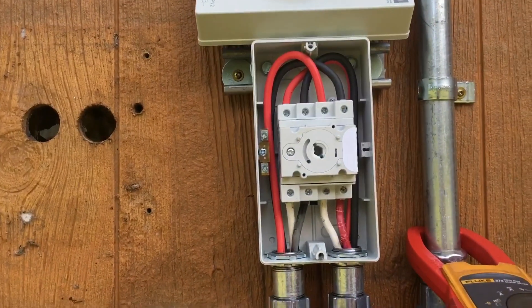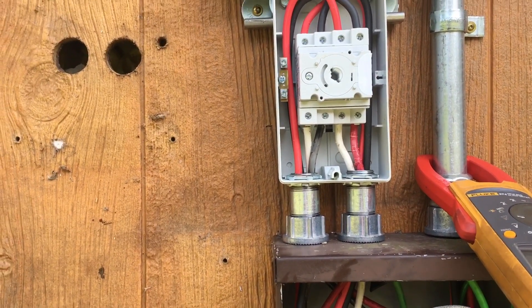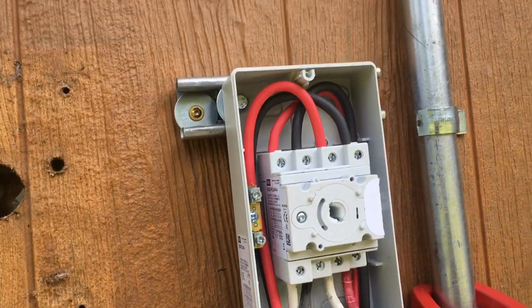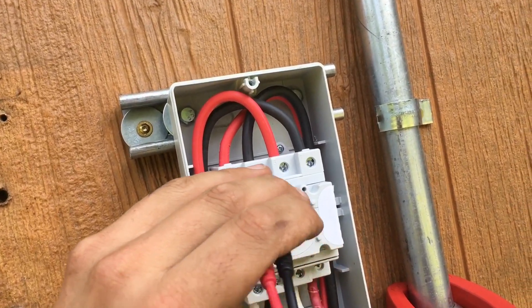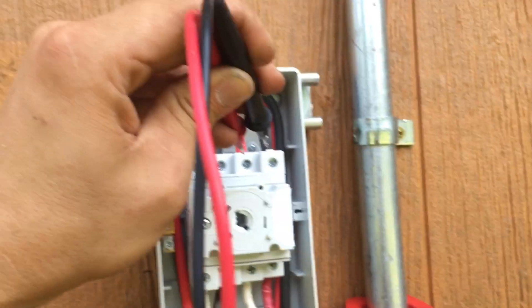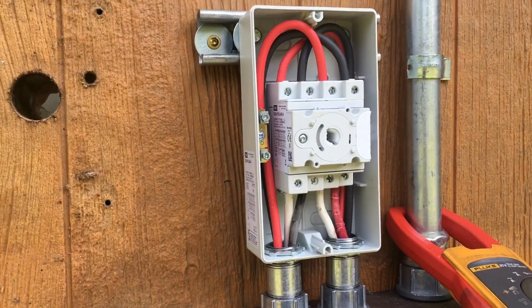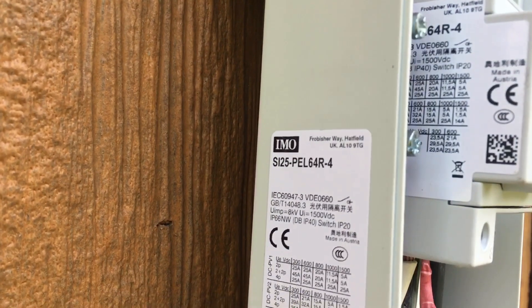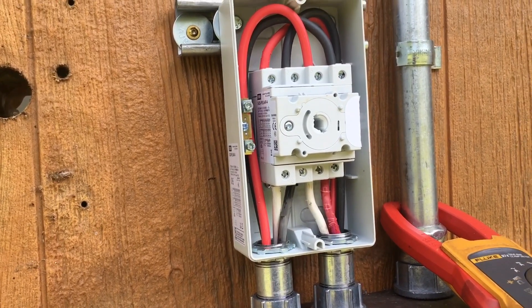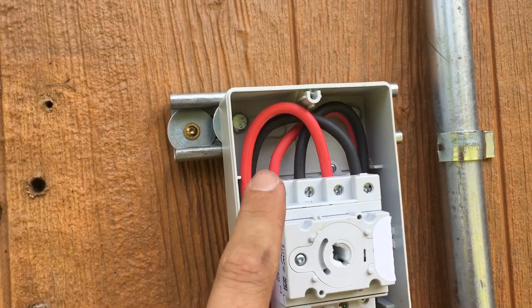A lot of you ask me about these IMOs. The body of the switch itself is a little bit flimsy, so I always like to mount it on a piece of strut — really get it solidly attached. Standing on some pretty solid nipples, but the switch itself is pretty bulletproof. There is 270 volts on the string of seven, and 315.8 volts on the string of eight. It's kind of hard to wire one of these four-pole IMOs — this is the 25-amp four-pole. It is a job to wire this thing with all eight conductors; those are actually number sixes going in at the bottom. But if you loop your wires back behind and just kind of swoop them in, it's not that bad.